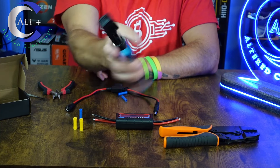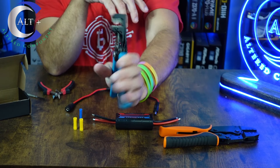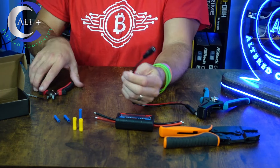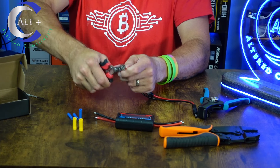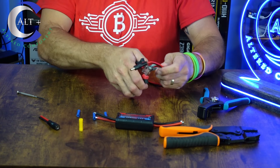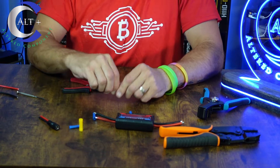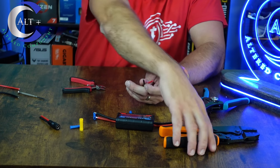We're going to use our nice crimpers here. We've got these super handy wire strippers — these things are amazing. I'll make sure to put a link in the description. The first thing we need to do is get some barrel ends, so we're going to chop back about this far on each wire — there's the black, there's the red, and there goes our connector. Same thing on this side. I'm not leaving a ton of wire because more wire means more resistance and more power used, so you don't want lots of extra wire.